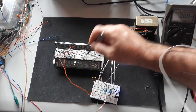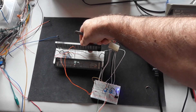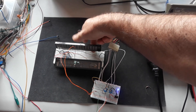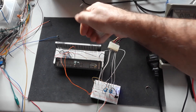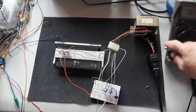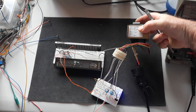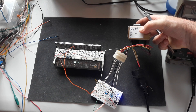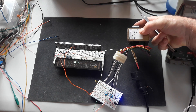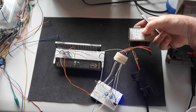If I switch to the other VFD you can see the brightness is strong. Also, because I don't have any reference when I connect with my finger here, you will see some variation of the segments. This is the transformer — here you have the marker and the reference. The connections I have done are: 2.34 volts, 0 volts, 2.34 volts, 40 volts, and 24 volts.